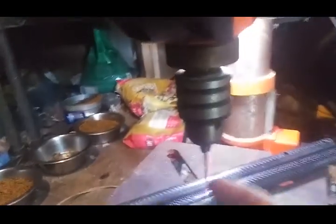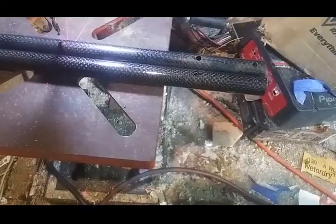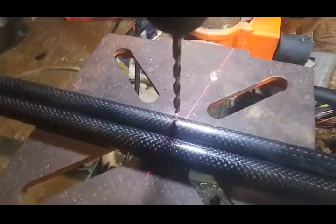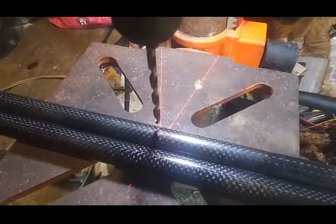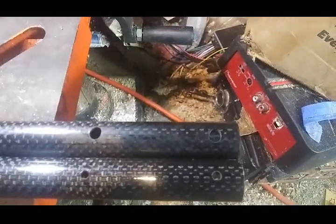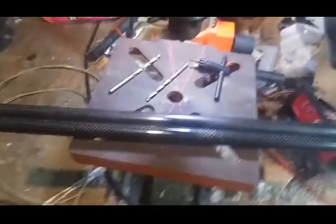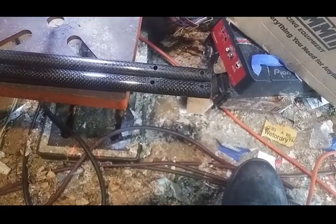With a big old 1/2-inch drill chuck and a huge spring-loaded key, bit changes are going to be non-trivial, shall we say. Okay, I stepped up 3 drill sizes from the pilot holes, and that's the next set of holes. This is another 3 drill sizes from these holes, and I might only need to go 1 more drill size bigger than this in order to match these holes on the far side. So here we go. Yep, 1 more drill size up and they'll all be the same size then. And there it is, the neck is drilled.